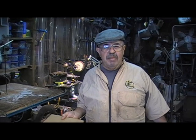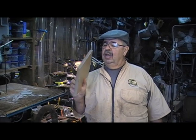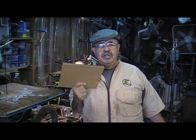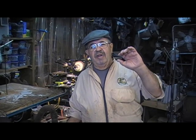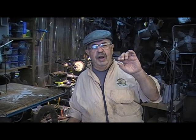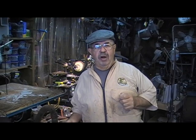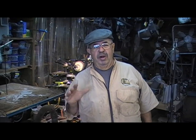All right, then I went to eBay and I found a couple of sites, and you can find some acrylic. And this is a nice product. This isn't the bulletproof Lexan that I was used to cutting before, but this is cutting pretty good. Now, I get 3/4, so I have some room to work. If I use 1/4 inch, I'm right on the edge. If I use 1/2 inch, I got a little bit, but the dome isn't going to get that big. If I have 3/4, I got a whole lot of wiggle room. That's why I like dealing with the 3/4 and thicker stock.